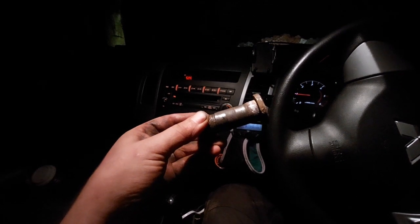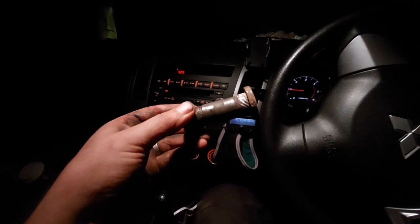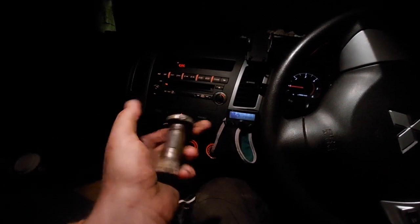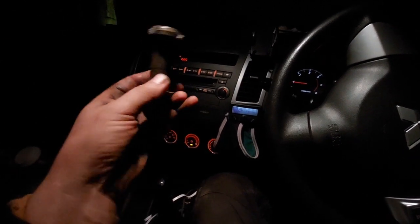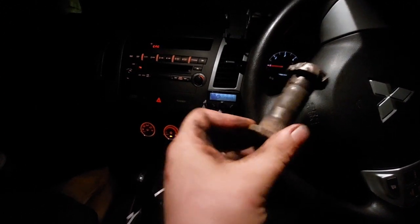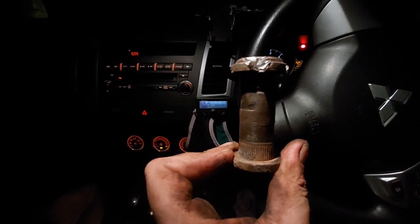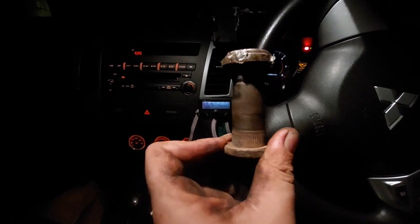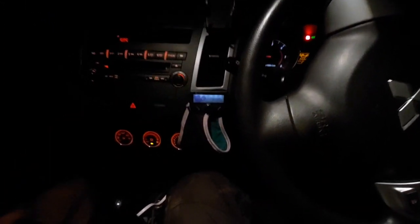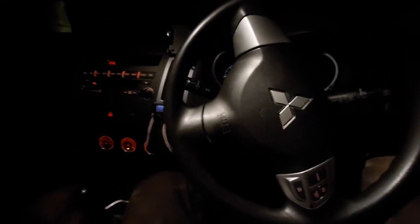There's a bit of wear on the top swiveling piece, but I think I can weld that back up and grind it back down and get that right. The bottom plate, a few marks in it, again, nothing I can't sort with a welder, but that nut is buggered, the threads ain't good on that, and you can see the marks there where the bearing's been chewing into it. So that will become a lovely paperweight at some point.